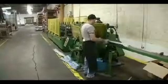Extruded cold roll steel blades allow Wing coils to make a consistent quality blade seal in bypass mode. Low friction nylon damper blade bearings provide smooth blade operation with no lubrication ever required. The MV has ARI certified performance and is available in a vertical tube configuration covering 56 sizes that handle up to 77,000 CFM of outside air.